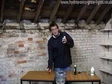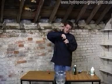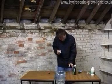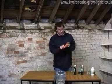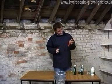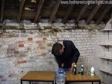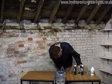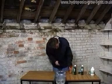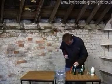What we're going to do is actually do it right now so you can see. So what I'll do is pour Buffer 7 into a glass. We then turn the meter on and then dip it in. Okay, now what we've got is a reading of 7.2. So 7.2 is slightly high, so it needs a little bit of adjustment.